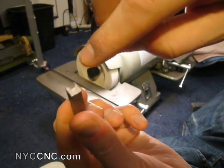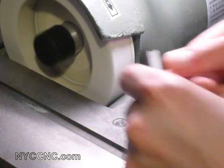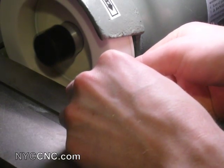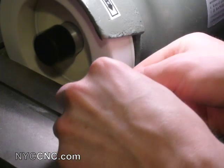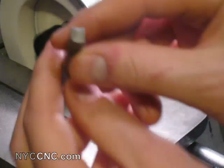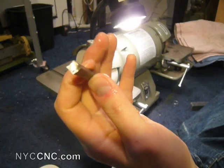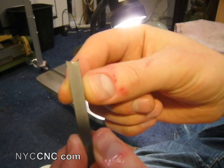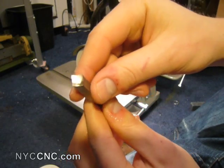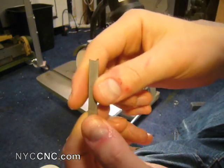What I just want to do now is try and clean up that lip so that it's more of a smooth face on the cutting face. So I'm just smoothing out the front face. Here's the radius profile and there's the front face of the tool. It's pretty smooth at the top. There's a little bit of a ripple at the bottom but that shouldn't affect it. I've got a fair amount of relief there. So I'm going to chuck this up on the lathe.